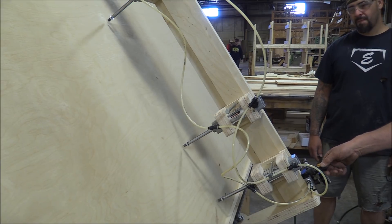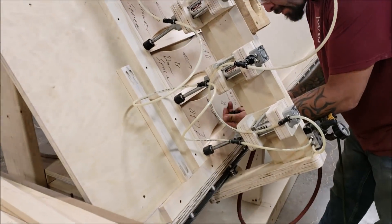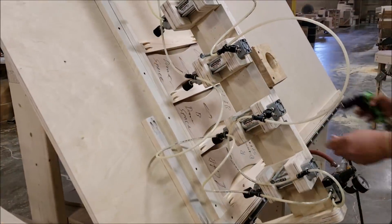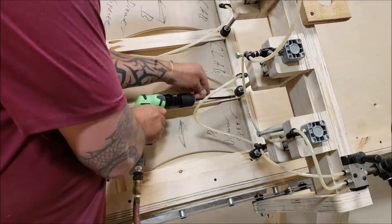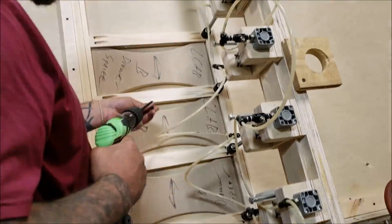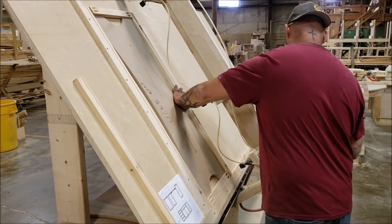In this case we used clamps with about a six-inch throw — meaning they actuate six inches in length — because we're going to use them for different size face frames. So you can do a three-quarter-inch face frame, a one-and-a-half-inch face frame, or a three-inch face frame if the need ever arises.